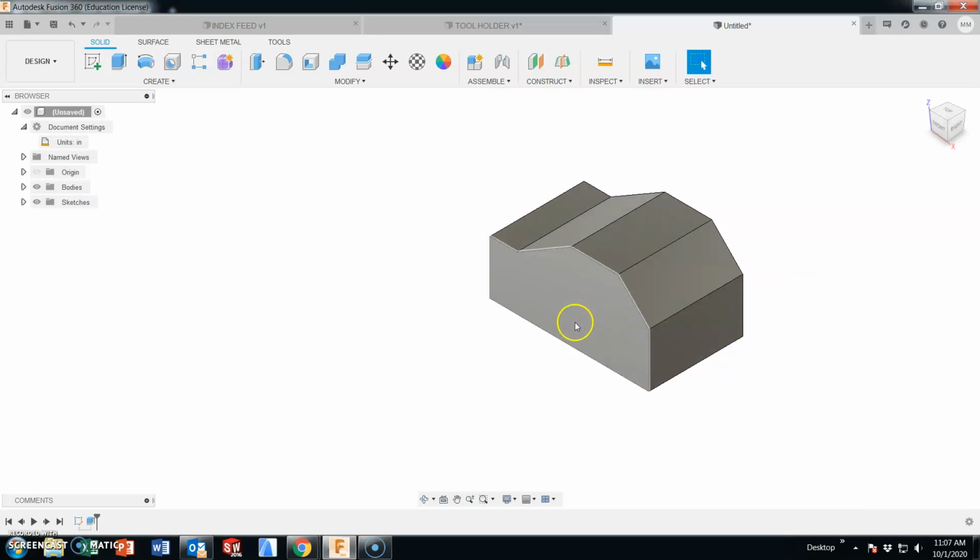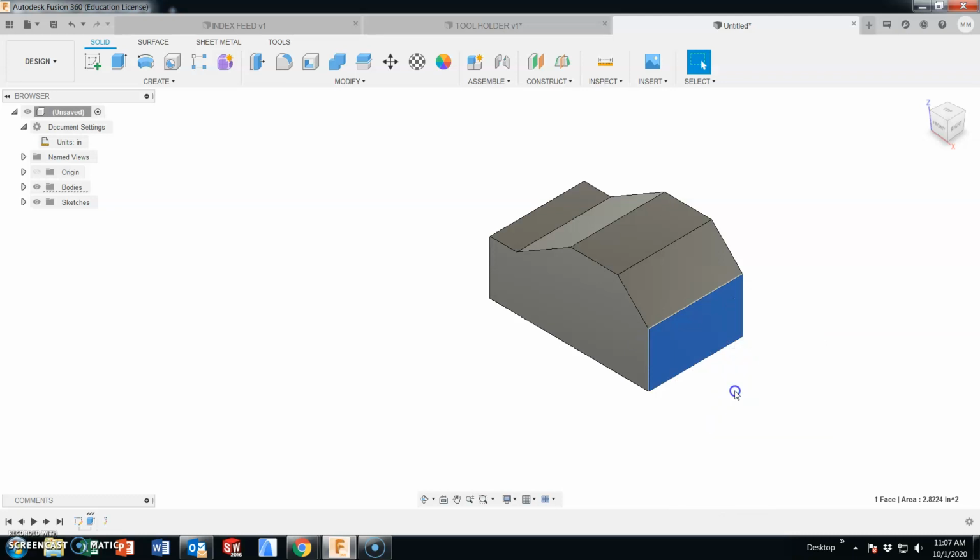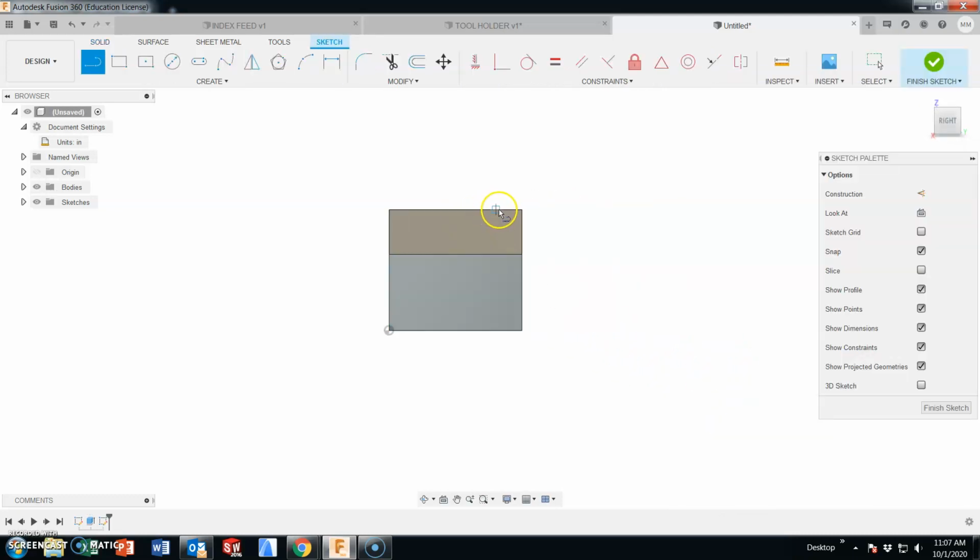Whether you cut the angle or cut the rectangle sections out, that is really up to you. I'm going to cut the angle first. I think it gives me a better option to show you some disparities in your design. It does not come all the way down to the corner of this 45-degree angle. I do need to complete the triangle. This is a 45-degree angle, and it's a 1/2 inch from the back edge.